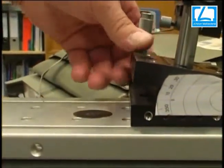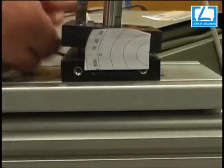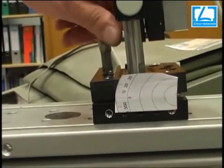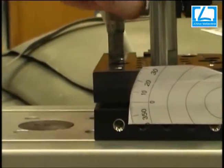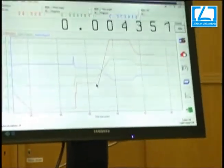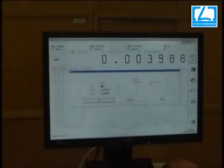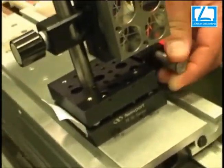You can see this stage allows only to bend about 13 degrees — it is clamping. This is pitch. Now 14 degrees, 15 degrees — it depends on the stage and the length of the screw. The other axis, the so-called yaw angle, is adjusted here with this screw.